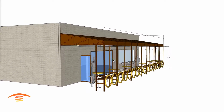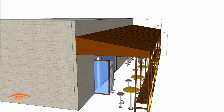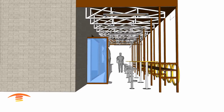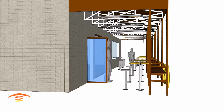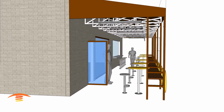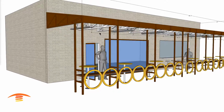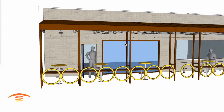I mean, you could, but this will give you some flexibility if you did choose to place some chairs over here in the future. Another thing just to consider is the fact that these are bar stool seating heights, so it's a little bit higher, and with that in mind, the heaters tend to be a little hotter when you sit up closer to them, so you need to consider a control system so that you can dim this down as necessary throughout the year and the season.